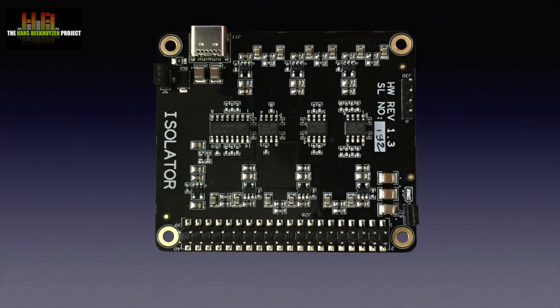The isolator is an optional board installed between the Raspberry Pi and the Katana board. It holds a set of four digital isolator chips that fully separate the primary and secondary side, so the board has a dirty side and a clean side. The dirty side can be powered from the Raspberry Pi but also has its own power input via a USB Type-C connector. A jumper bridges or separates the dirty side of the isolator and the Raspberry Pi. The preferred way is connecting the power supply to the USB Type-C connector on the isolator and bridging the jumper to feed the Raspberry Pi from there.